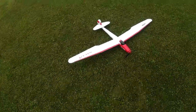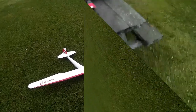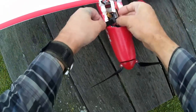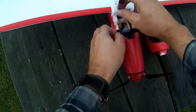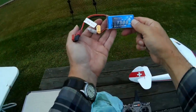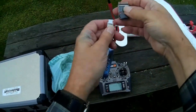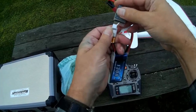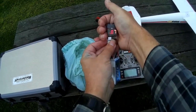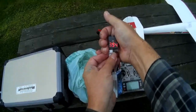No major problems with that. I'll stop recording for a bit and check the battery. Getting it back to the bench to take out the battery and see where we stand. That's a brand new Gens Ace 1300mAh 2-cell. It's reading 7.87V total - 3.93V and 3.94V per cell - this is after two minutes of motor time.